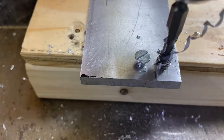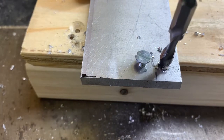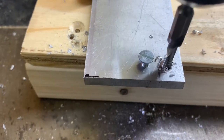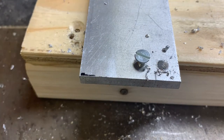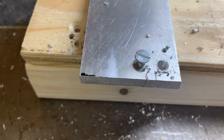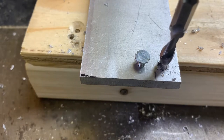Okay, it's hitting some of the stops on the drill, so we're going to back that out. Turn it up a little bit, we're going to go back in. Going to adjust it for a little bit more stiffness on my drill, but still not the max, because I do not want to overstress this tap. So here we go, back in.